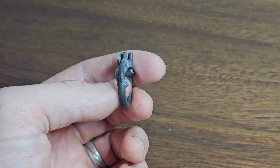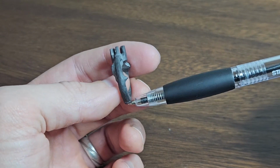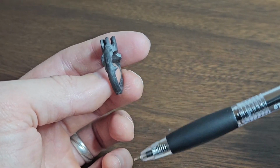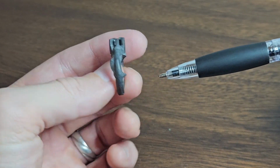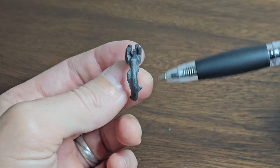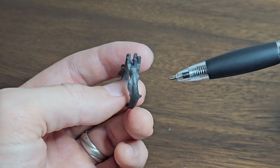It's not really a single point where things stop working. It's more a point of increasing difficulty where you have to get the metal heated up to a higher temperature, and it requires a higher column of metal within the sprue to get things forced through. But depending on how adventurous you want to be, you certainly can get more finely crafted models than what I am doing here.